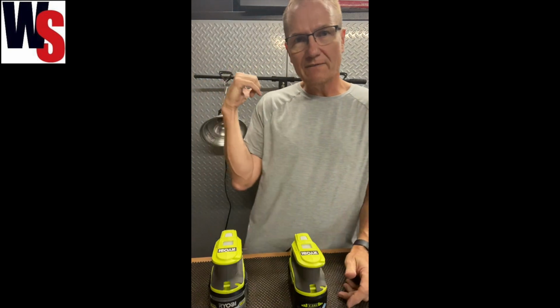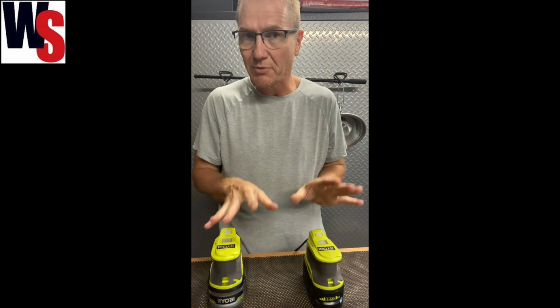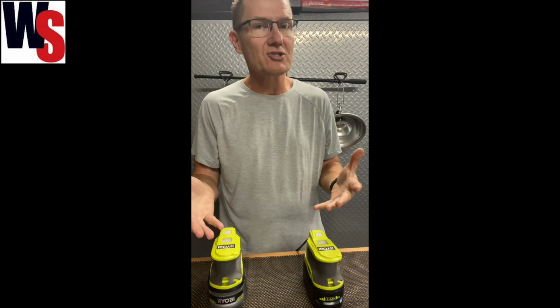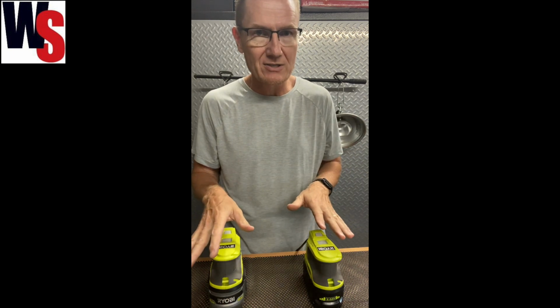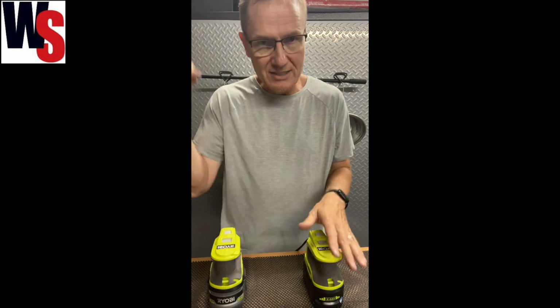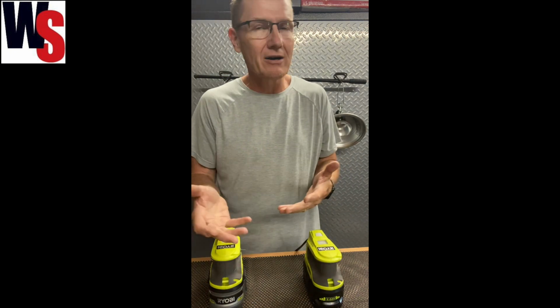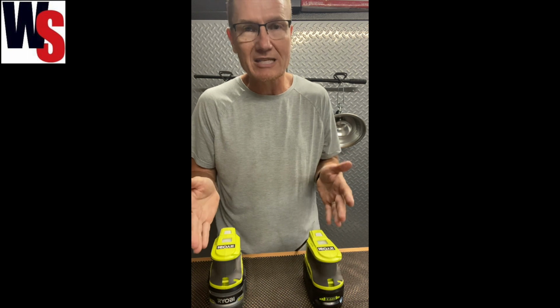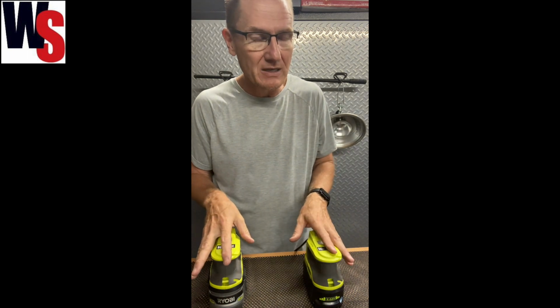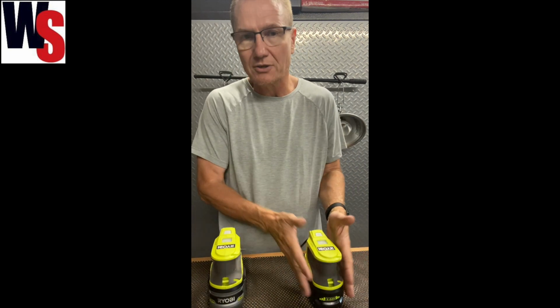Ideally, with my 75 watt floods that you see right behind me, when we turn those on, these should last approximately the same time because they both have the same wattage. From my past experience, when you're talking about such a huge price difference, you're hoping to get about half the runtime. Now, 75 watts there and 108 watt-hours on each of these batteries. It should give us around an hour's runtime, is what I'm expecting if the batteries are equal.